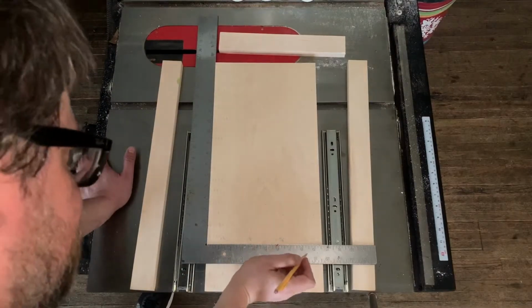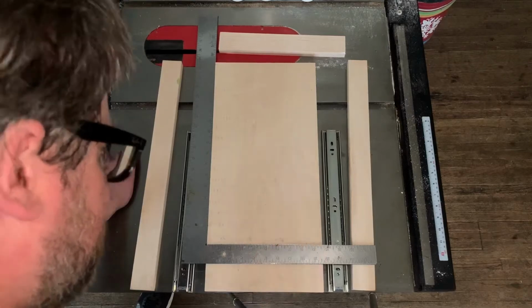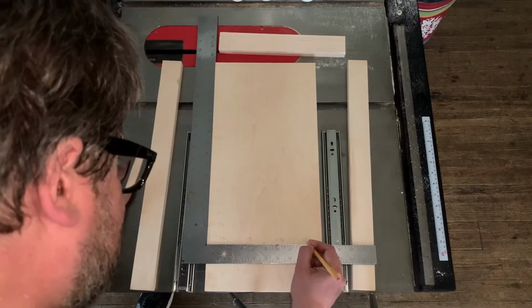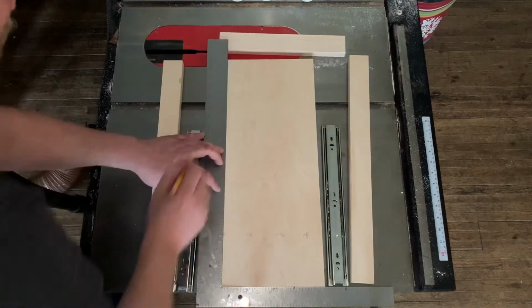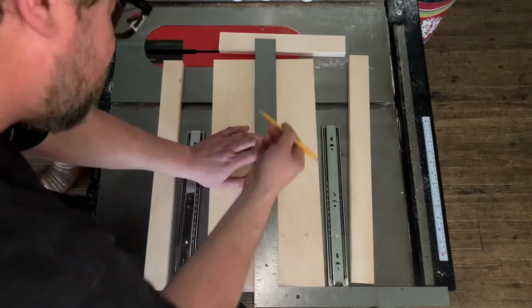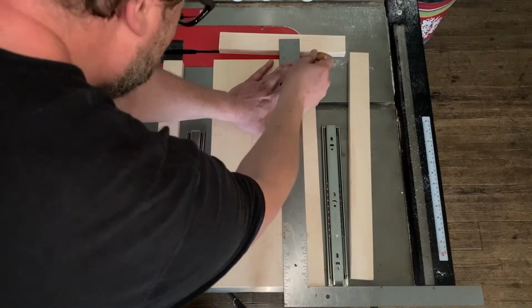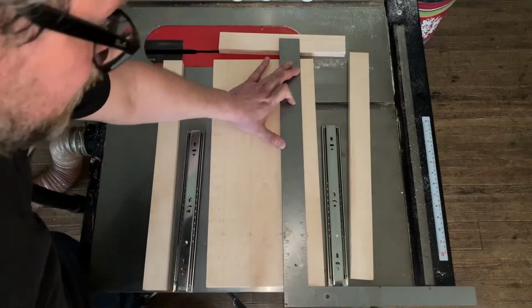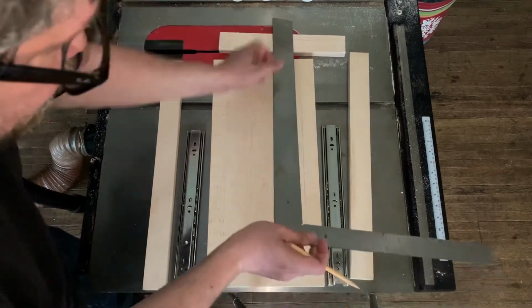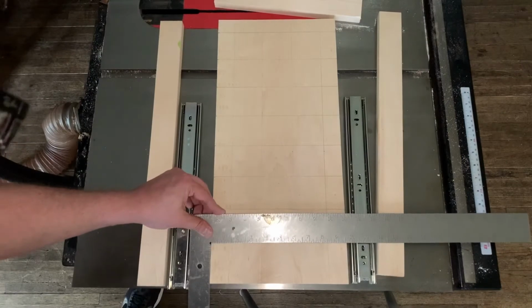That's pretty much it. You get one of these L-shaped rulers, and you want to mark off where your long lines are going to be. The measurements are in the description. This is going to be a 10-inch wide middle section to this K-cup drawer. So we're going to do 4 rows on the long way, and then 8 rows going the short way. So that makes for 32.